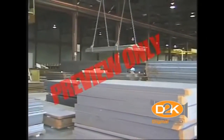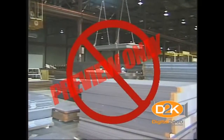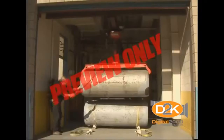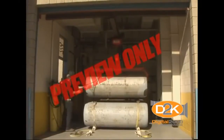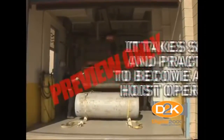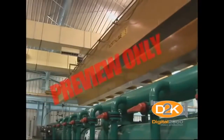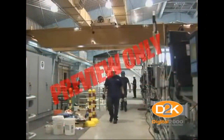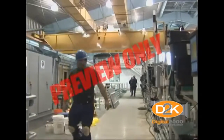Here is a simple rule that gets violated far too often: loads must never be suspended over personnel, and under no circumstances may anyone ride the hook or load. Directional movement should be made smoothly and deliberately. Avoid rapid movements in any direction. It takes skill and practice to become a safe hoist operator. Workers who may be standing in the direction of travel must be directed to move and remain clear at all times. Immediately stop the lift and move anyone who might have wandered into the direction of travel or under the load.